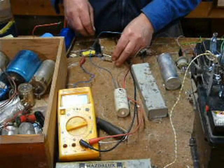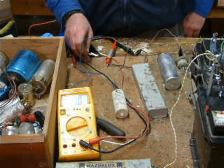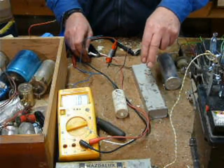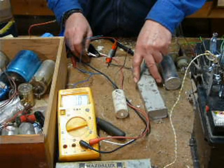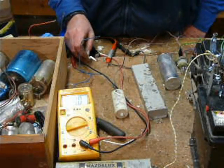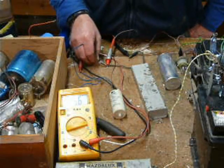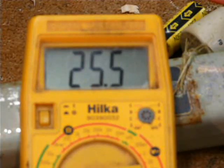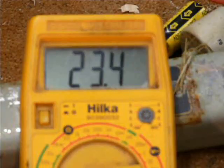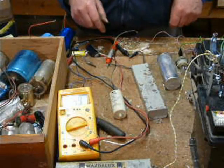Let's try this big one here. I'm going to have the meter going. What should happen once we disconnect the power is that the reading should go down slowly. A lot of these capacitors have what's called bleed resistors in them to stop them keeping a charge. Negative through there, positive — meters connected — contact. That meter should show 25-point-something now. Disconnect... and it's going down. So with that backwoodsy test, I'd say that capacitor would do the job.